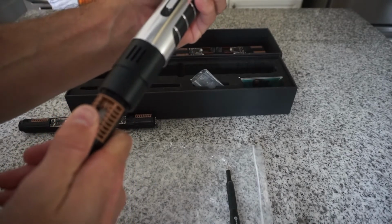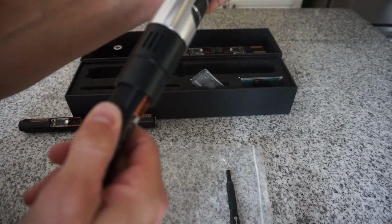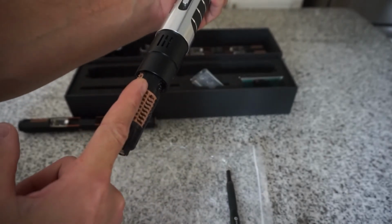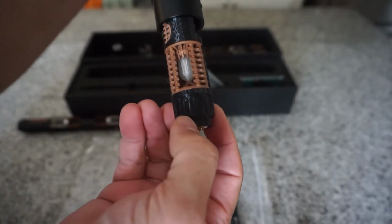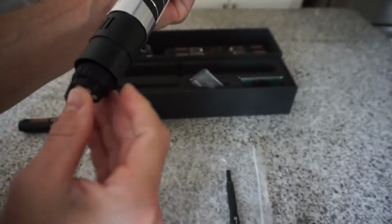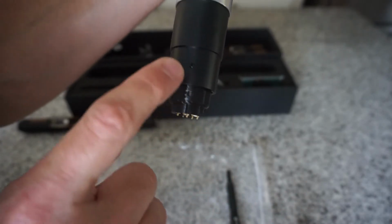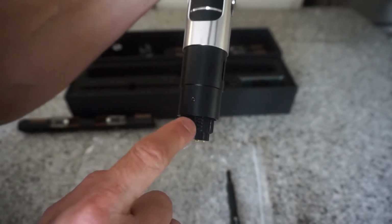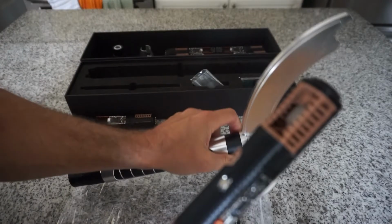But that's your general idea, right? There's a couple of things. Like I said, we could use the switch in the sound vent to get orientation, and once you're there, you have your crystal chamber that you can use as orientation, and even this hole, hopefully you can see that on camera, this little slice in the PCB holder area, as long as you keep that centered. And that's the other thing too: there are little indentations in the chassis for the retention screws. They're not holes, just little indentations, but you can use those as alignment as well. Okay, that's two of them.